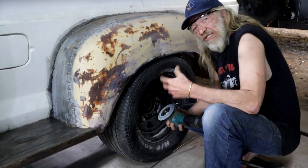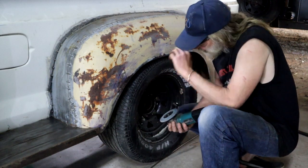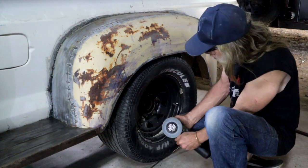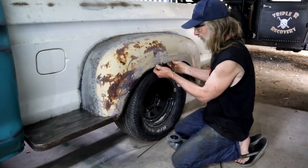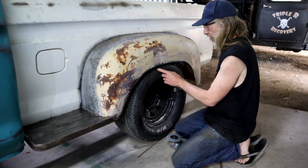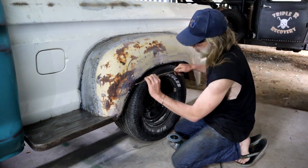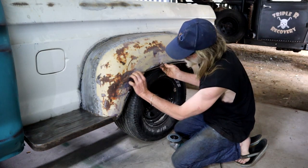In one of my typical OCD sessions I've been messing with this shape for quite some time — enough now, the bellies, it's good enough. So of course there's no lip on this now, so it's quite floppy. What I'm going to do now is edge it with a piece of quarter-inch round bar, six millimeter. I'm going to tuck that onto that edge and that will stiffen it up nicely.